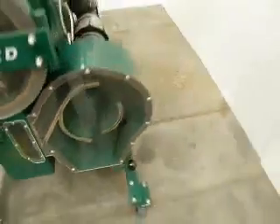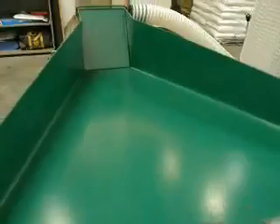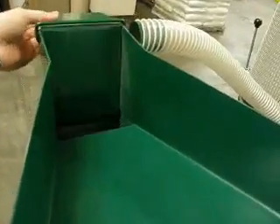The Kimseed Multi Seed Thresher hopper is designed to hold a large quantity of samples which can then be fed into the threshing chamber. The hopper is fitted with a cyclone extraction system which has a variable suction to reduce the dust created during the threshing process. The suction is varied by adjusting the valves shown.